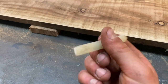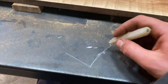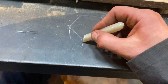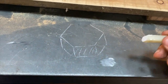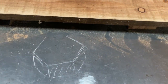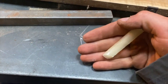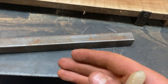I was going to ask what this is but I need to use it — it's engineering chalk, or French chalk. It allows you to draw on metal. So this is my bar — this piece here is one of the five sections, and this gap is going to be left open. I've made a frame that's steel all the way around these edges, made of this section. I'm making these hooks that will sit on the end and hook over the top, so I can take my sheet, hook it on top, all the way around, and secure the base as well. It just means it can be assembled and disassembled really quickly.